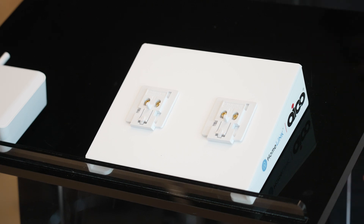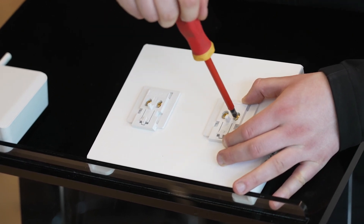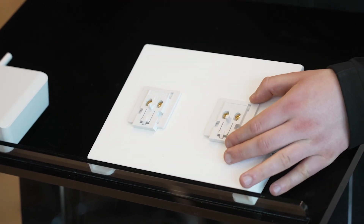When it comes to installing the base for the environmental sensor, all installation should be done with simple hand tools, which is simply a case of tightening down either screw. Once tight, back the screws off just half a turn to ensure that no excess force is placed on the base.